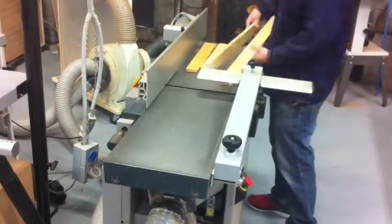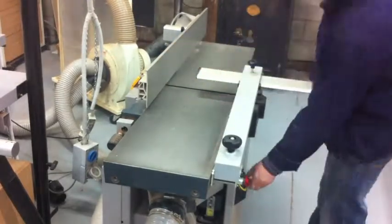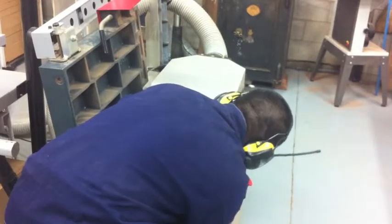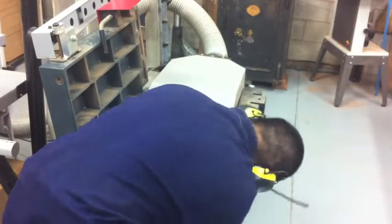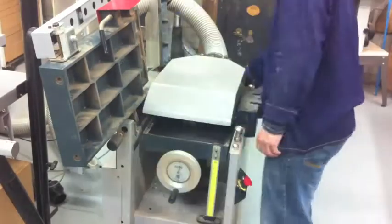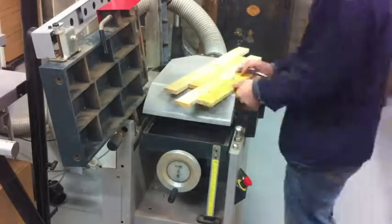Next step is to start on the back panel. I machine the sides, top and bottom rails to 15 mm thick. This hammer joiner thicknesser has been a good workhorse over the years. I got a combination machine because when I purchased this machine, my workshop was a lot smaller. Now that I have this larger workshop, a standalone thicknesser is next on my shopping list.